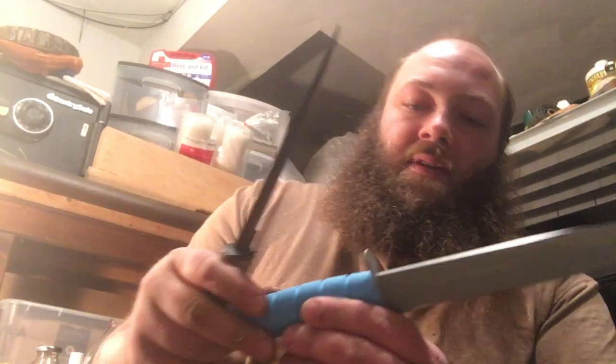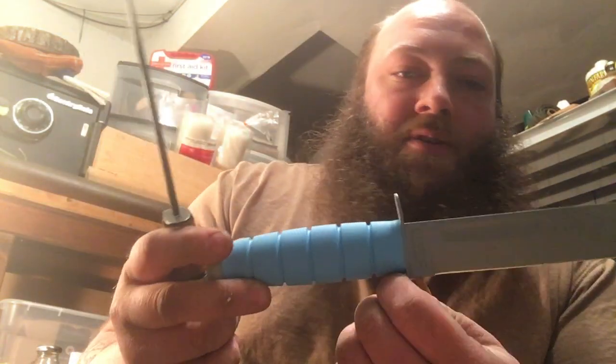I think the vanadium might add a bit of toughness as well, but it's in very small amounts — probably not perceivable to most people. If you gave me one of each I probably wouldn't tell the difference just by using them. But 1095 is a great, very tough steel — it's been around a long time. I do have several knives in 1095 and probably four or five in 1095 Cro-Van. They'll both rust very easily, which is hence the coating.